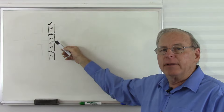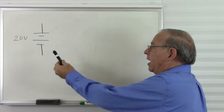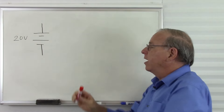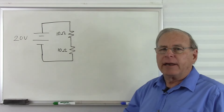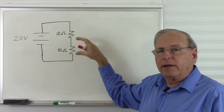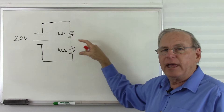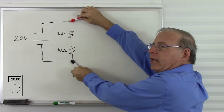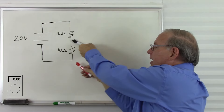Now here I have a stack of four batteries supplying a circuit that expects both positive and negative voltages, so I make my ground in the middle. What can I do if I have only one battery? Here I have a 20 volt battery. I can put my ground at the negative side of the battery and measure positive 20 volts, but what if I have a circuit that needs both positive and negative voltages? Now I have two 10 ohm resistors in a series circuit with my 20 volt battery. They're equal resistance, so they must have equal voltage, and those two voltages must add up to 20, so I must have 10 volts here and 10 volts here. Putting my negative lead here gives me zero volts, positive 10, and positive 20. Putting my lead in the middle gives me zero volts, positive 10 volts, and negative 10 volts.